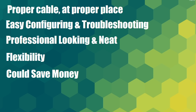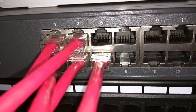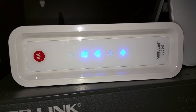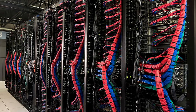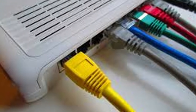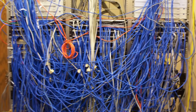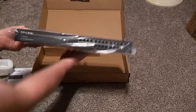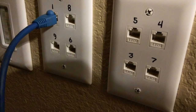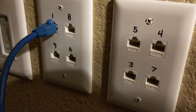Number five: in larger applications, it could save you money. In a large home or office with lots of connections, a patch panel could save money. With a larger office, patch panels make quick work of reconfiguring networks, so your techs can get in and get out quicker, saving money. If you don't use a patch panel, your cables will run to the switch, and even the unused cables are taking up a port on the switch. If I had more than 24 ports in my house and had them all plugged straight into the switch, I would need another switch, even though not all of the ports on them are being used. With a patch panel, all of the ports around my house are still ready to go at a moment's notice, and yet are not taking up space on my switch, nor just hanging in there when not needed.